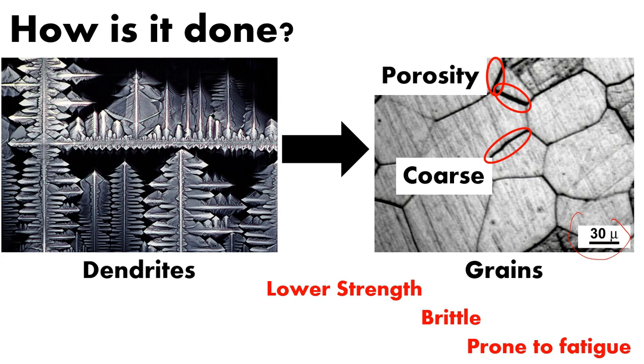If you use steel made straight from a casting, it's much more prone to fatigue failure — meaning if you load and unload it through different cyclic loading, you're much more likely to have a fatigue failure due to these grain issues. The very structure of the metal — the grains it's made up of — actually determines the mechanical properties you'll get in the final metal. So what can you do to manipulate these grains to get much better mechanical properties? That's when forging comes into play.